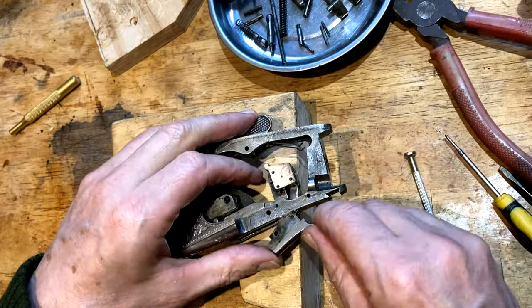There's that little roll pin we need to release, and then there's a little spring section in there too. You'll notice this is done in no particular order. Right, finger over that and release. Tiny little roll pin. This quite often gets full of crud and impacts. There's a little spring inside here, which is quite often full of dirt. And I think it is today, possibly. Yeah, it's there. I can just about show it to you. It's stuck in there at present. But it's there, nonetheless.